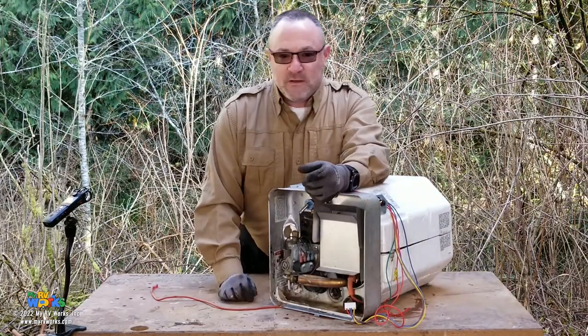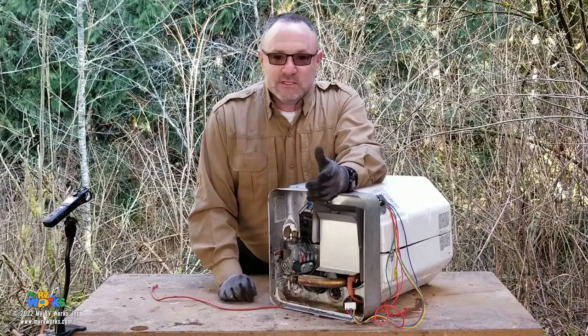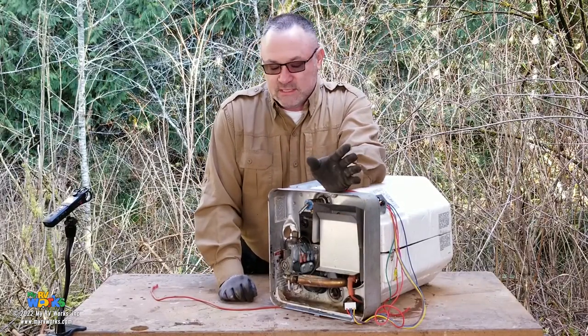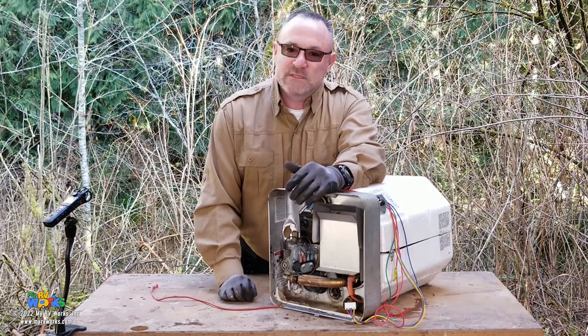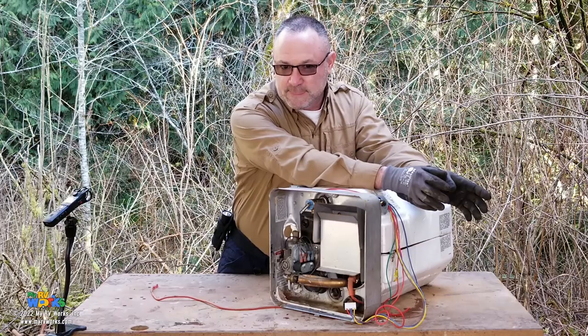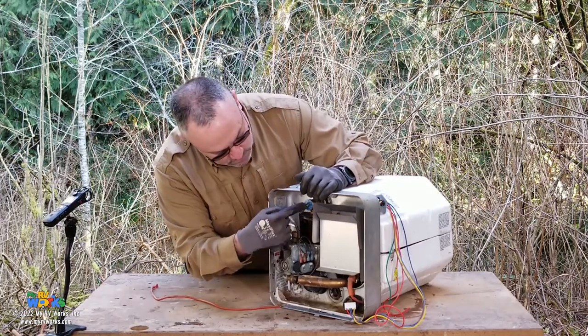Let's say that you know your pop-off valve is good. Let's say that you know that everything is good. Let's say that you have a 40 PSI regulator on your hose and everything's fine and you're still weeping. At that point, I would say let's get an accumulation tank over here to help take up some of that pressure, okay? So pop-off valve here.